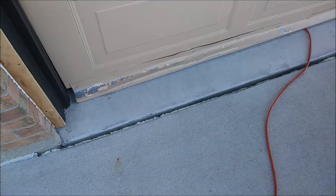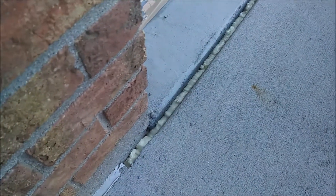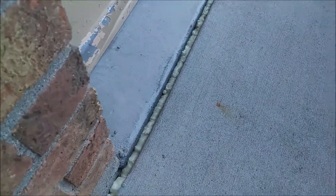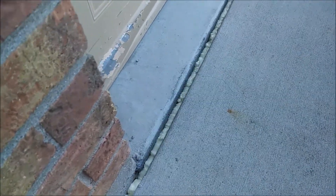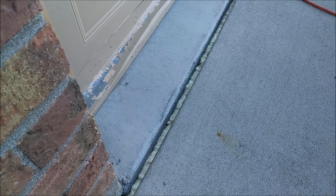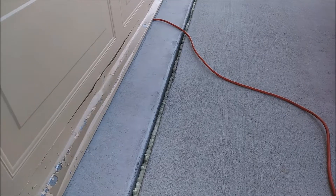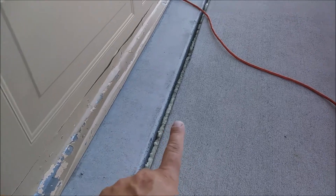Welcome back — here's our little driveway sealing project. I cleaned it out and it actually went down about five inches, so there's definitely a lot of depth to fill. Quick foam was my solution, and I think it's going to make a fantastic seal from one end to the other. Water has to get through the caulk and then through the foam to do any major damage to the slab. Hopefully this will be a more permanent solution — he sealed it last year and it only lasted one year.